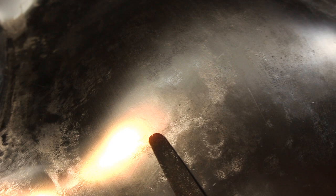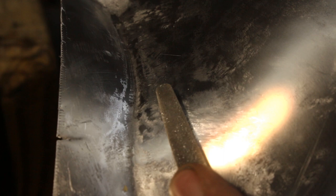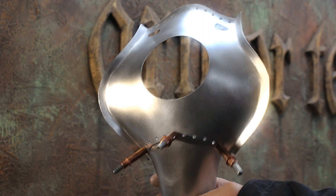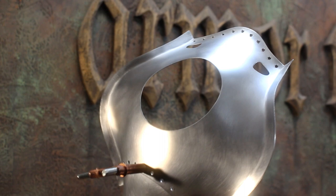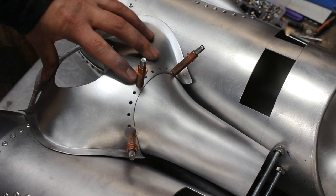The surface is not quite perfect, although the camera makes it look a little worse than it really is. A tip I like to use: I just take a nice flat file — it's got a rounded edge on the other side — and rake it over the surface in all directions. It will flatten it out very nicely, and then after some sanding, this is what it looks like. This is a beautiful part and it goes on my Rocketeer jetpacks. Jay Jarvee is clearly a genius — a very smart man — and I've learned so much from him. He has my very favorite YouTube channel currently, so make sure to go check him out.